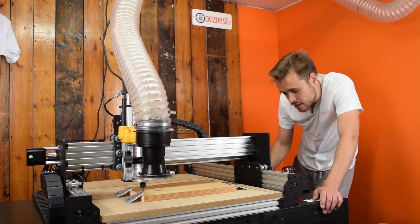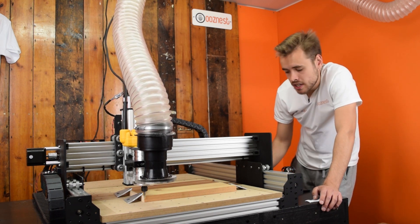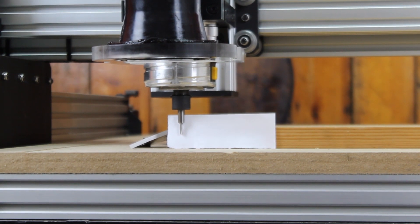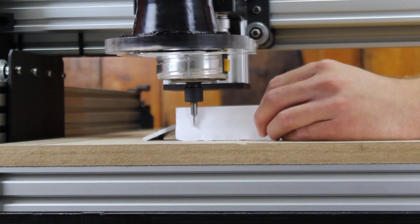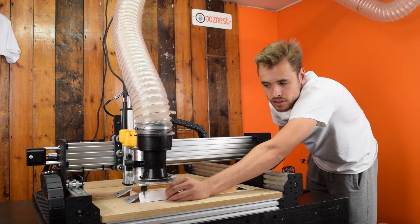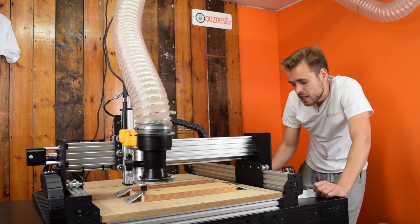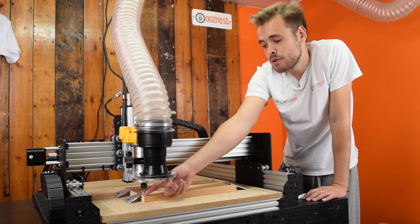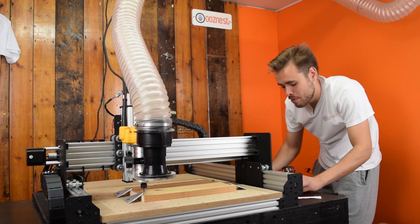Repeat the same procedure for the Y. Bring it back down so it will at least touch the edge, and now let's put the paper in position. Reduce the step size down to 0.1mm so you can accurately locate it. So I can just feel that bit now — the edge is now in line with the side of the end mill, but we actually want it in line with the centre. So I need to move it in the positive Y axis half the diameter of the mill bit, so 1.5625mm.